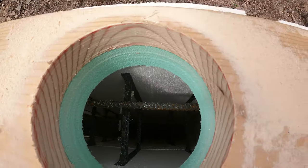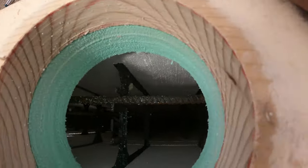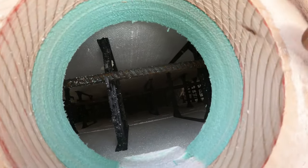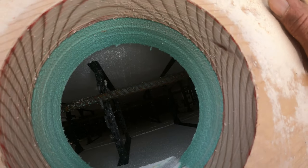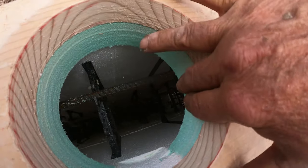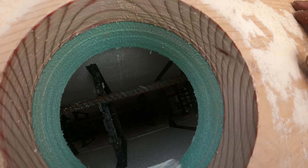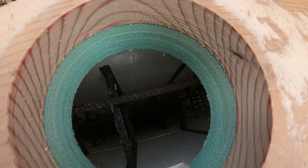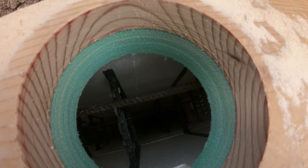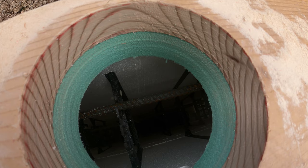As you can see, now I can pour down in there, and I've got the styrofoam underneath. So none of this wood is touching cement. Everything has styrofoam in between the cement and the wood, which is why I got away without having to use treated lumber. It also made for a better insulation factor than just wood against cement.